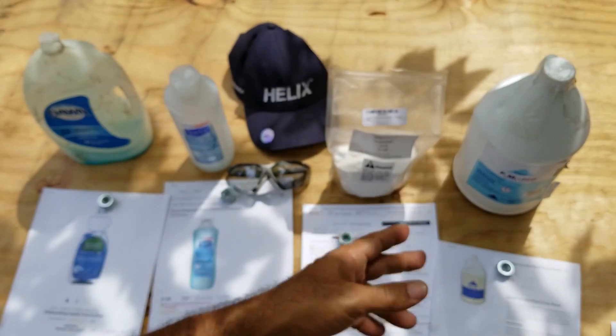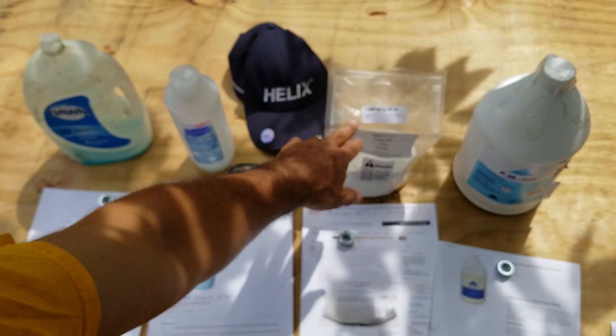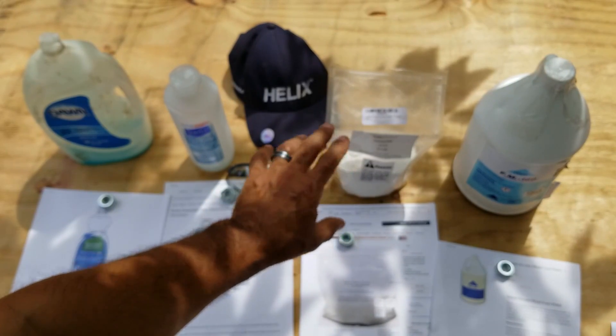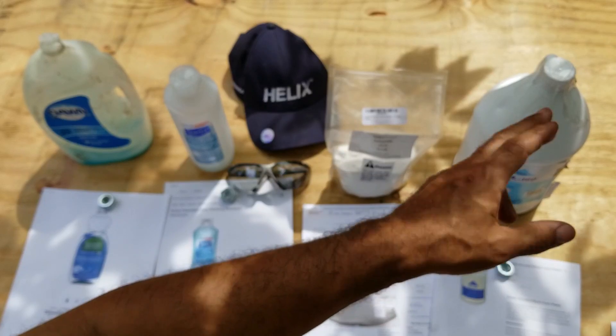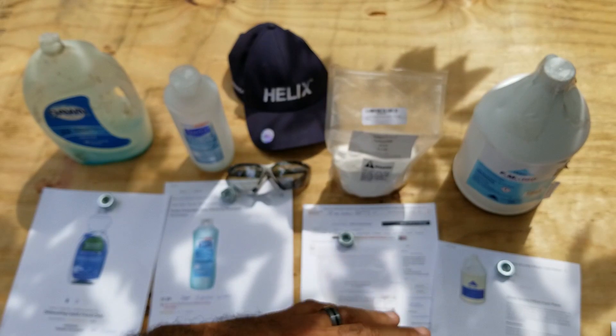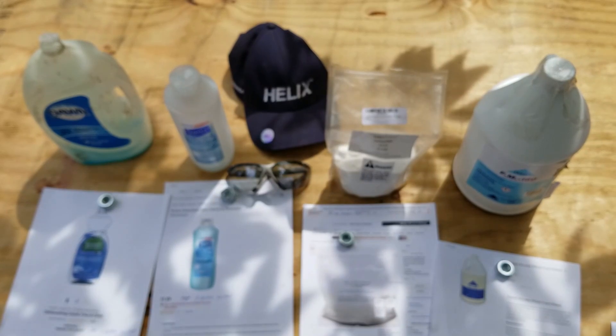But for construction — to build a structure or foundation — you can't beat the Drexel. I will be doing further testing with the sodium, adding some other additives to get the aircrete to set quicker, so that you don't need the very long-lasting bubbles that you get from the Drexel. With the Drexel, your foam will last for hours, and this is important with your aircrete because once you mix your foam in with the cement, you want your bubbles to stay until your cement cures. Otherwise, if your bubbles collapse, you won't have aircrete — you'll have regular cement.